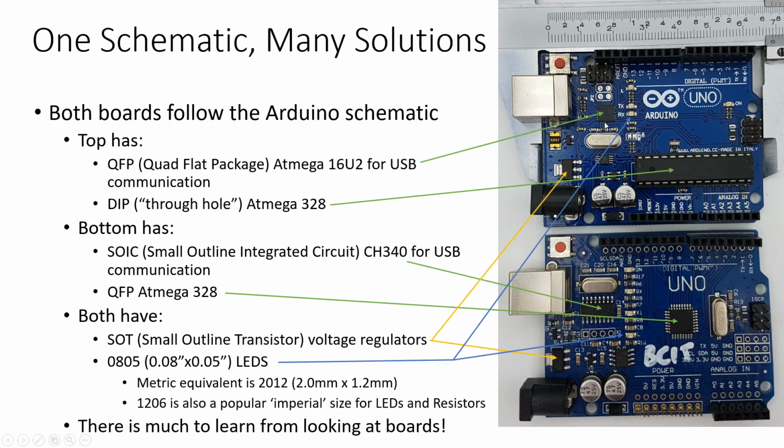Now, although this is a QFP over here, this is also a QFP right here, but with a different pitch on the pins. So this one right here, if you were doing hand solder work, is probably still within the realm of what you could hand solder. And this is probably within the realm of what you could solder when you were like 21, if you were really, really calm. Maybe target shooters can do that. Anyways, it's a little more challenging to solder by hand.